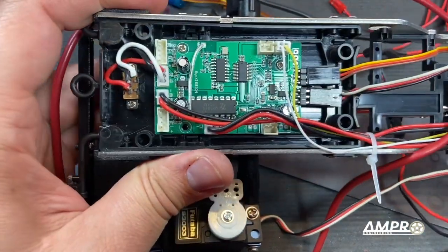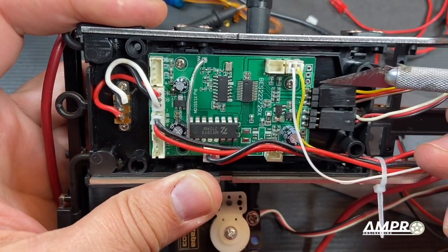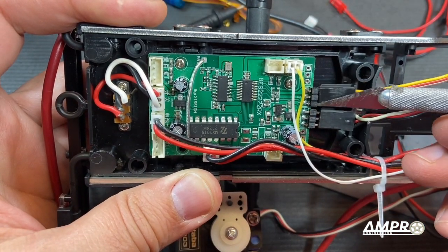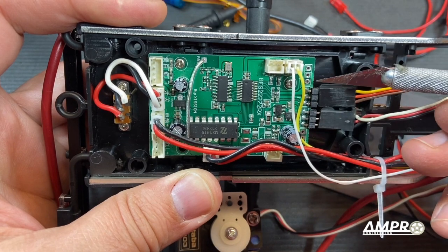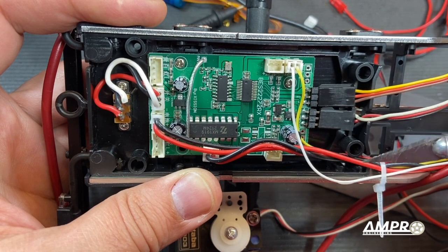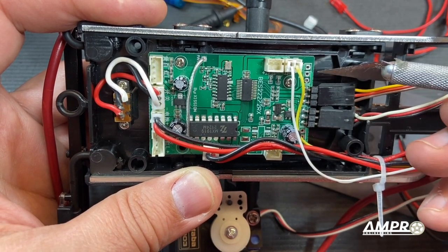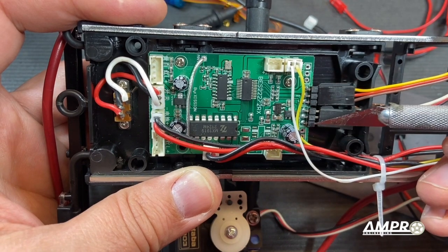Interestingly enough, I was sitting here looking around and I realized that right there we have some blank ports. Obviously, they look just like these here. So reading the voltage, I found that this port, the positive and the negative here, are 5 volts. So is this, and so are these. So these are all 5-volt ports on the PCB.